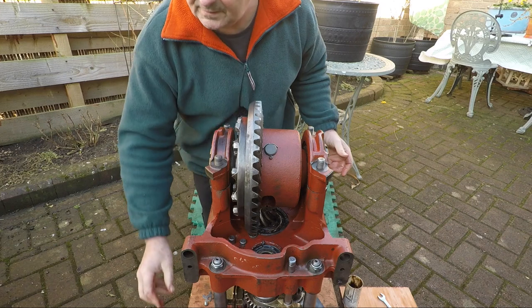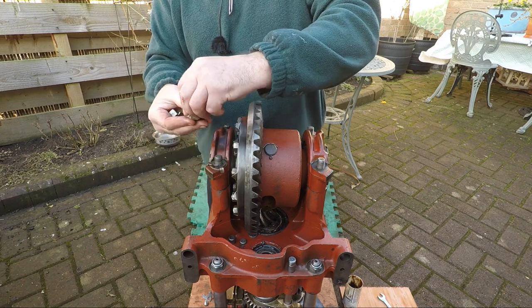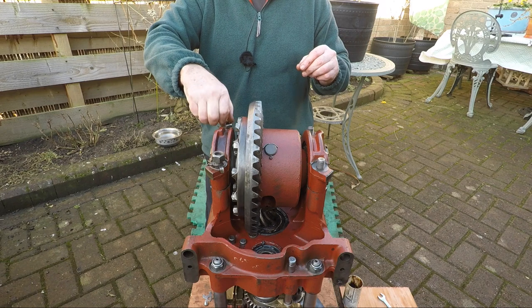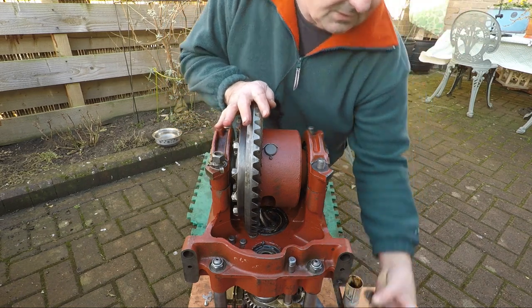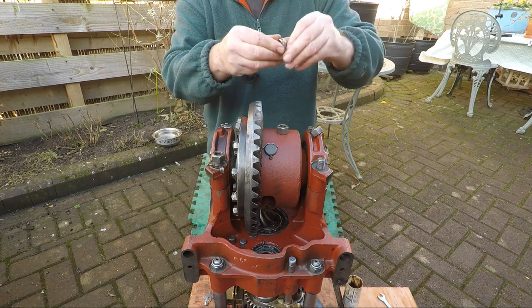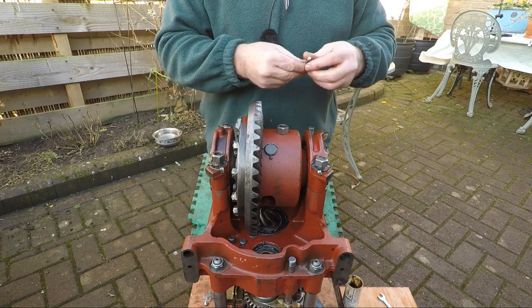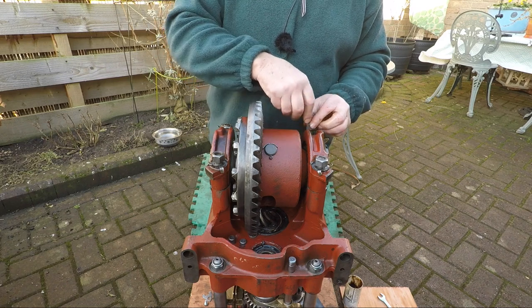Okay. Nuts and washers. So we've got here our little star washers. We go on our 15/16 nuts. I got me a bit of wood underneath me skateboard as well here, because this now will be an absolute ton weight. All these, as you can see, been all wire brushed, cleaned up. Pop them back on there. 120 foot pounds, these. One upside down, there we go. Pop that on.